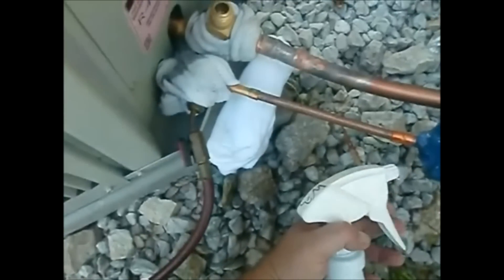What valve do you open first? I've been in the trade a while and ever since I was an apprentice, I have opened up the suction line. And I'm going to tell on myself here — I don't know the real reason why I did that. I guess I was following suit with how my journeyman always did it. But we need to know why we're doing things. The controversy is that a lot of people are saying open the liquid line first. But the suction line people say if you open the liquid line first, the oil out of the crankcase is going to shoot out and hit the TXV, and you're going to get a big slug coming back to the compressor and possibly ruining it. So we're going to go right to the horse's mouth.